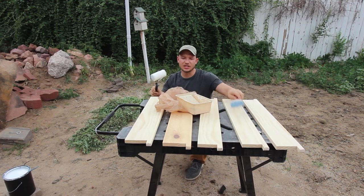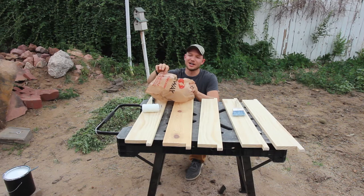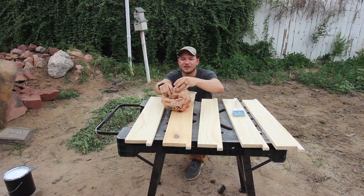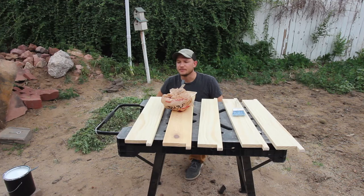I'm going to be using a little paint tray, a small roller, and a brush for the edges. One tip when using the paint tray: take a grocery bag instead of buying the liners, put it in there, and put the paint right in. Between coats you just leave it in there and wrap it up — the paint will stay for a couple of days. Since we're painting raw wood, we want to use a primer or a primer-paint combo. It's probably going to take three coats.